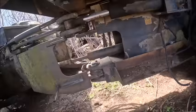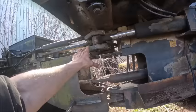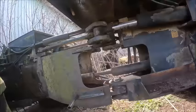The biggest one, and the most obvious one, is that they took this entire center section and flipped it over, and the stationary pin moved up top. It's not stationary, it's actually a ball pin, or a ball joint of sorts, but you get the idea. And then the steering yoke and everything moved down here, the cylinder moved down, the stabilizer bars, everything was down here, and that greatly improved this center section when they did that.